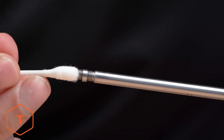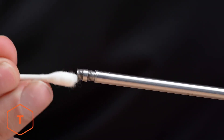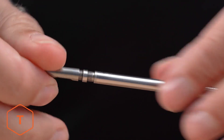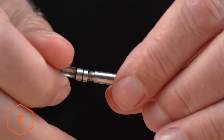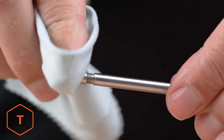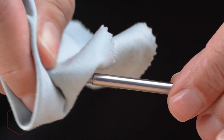Finally, to get the best image quality from your bore scope, clean the camera lens and mirrors before and after each use with a soft microfiber cloth and a cotton swab. For stubborn stains, you can use warm water or rubbing alcohol, but don't use stronger solvents.